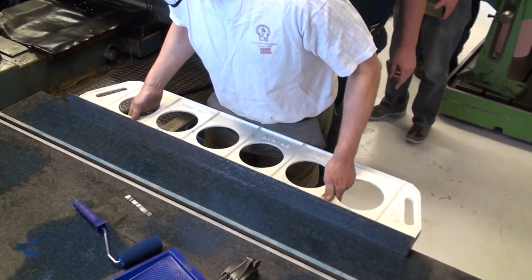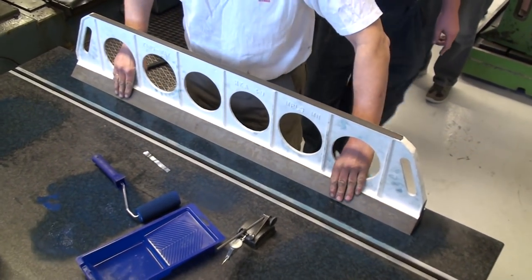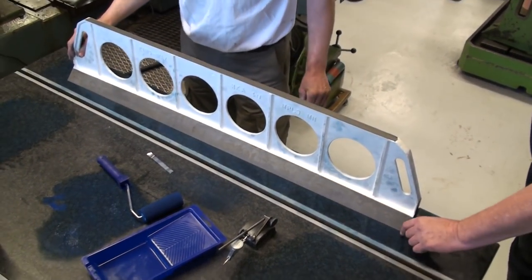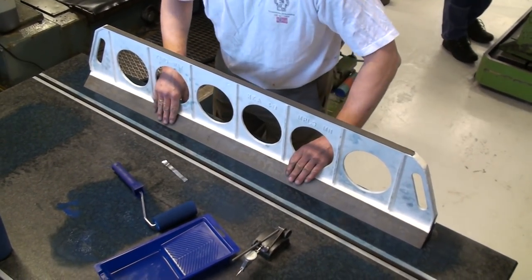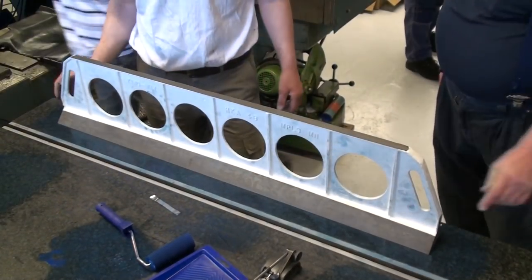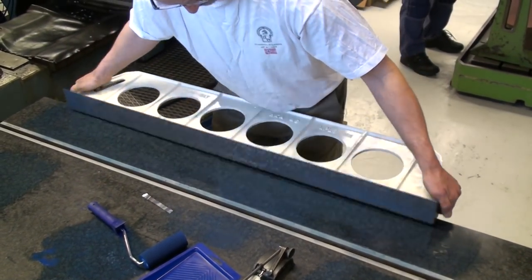And after bluing, it showed that the bluing pattern has moved. That means that the stress relieving did something to the straight edge, and it moved slightly, hinging the part and rubbing it good on the blue and checking the surface.